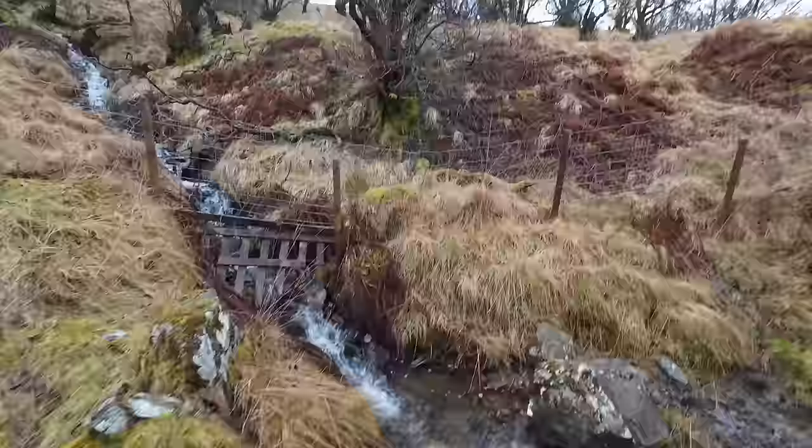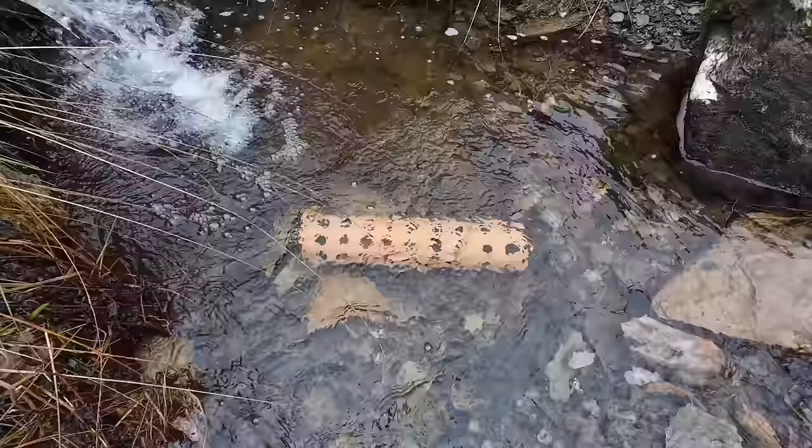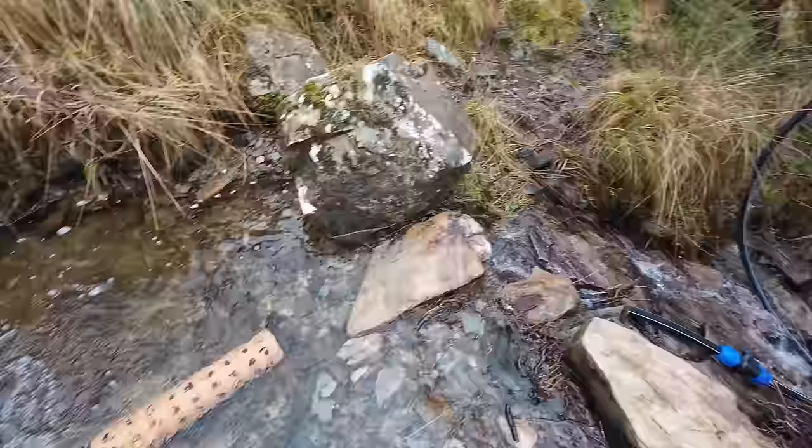These are the intakes — they're just 110mm drainage pipe with holes drilled in it, going down to a stopcock. There's also a vent tube to let any air out. I've had a bit of trouble with the weight of the pipe with water in it pulling down and popping the end off, which can be a problem.